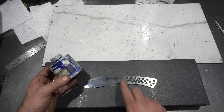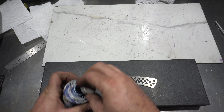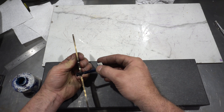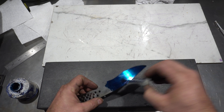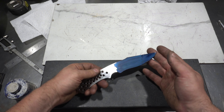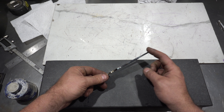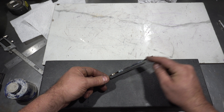We're going to coat the blade on both sides. So we've coated the blade in blue Dykem. Now the first thing we're going to do is put the scribe line to know where we're going to scribe the bevel to.